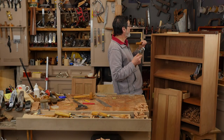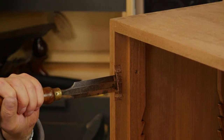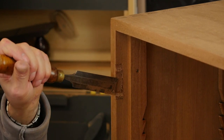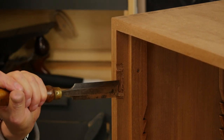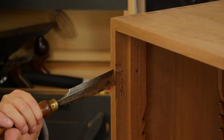Going through the face, I go directly into my groove with the gauge. Take out the mid section first, then creep up on the outside section because you may not be deep enough with your perpendicular cut — I'm staying away from my knife wall a little bit. Fold that out of the way and do the same on the top one.